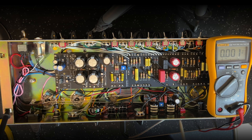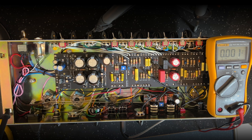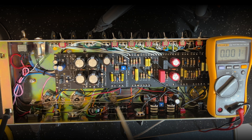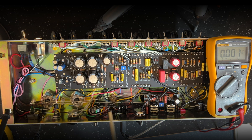With this 25-watt build of the Kelly here, I want to point out a couple of things that might be of interest to anyone contemplating building with one of my boards, or maybe you already have and want to make some changes. These boards — I've mentioned this in the first build basics video — you can pretty much build any wattage with these: 25, 50, 100. The Kelly board and many of my other boards are set up for fixed bias. I do have one board that does cathode bias — that's the mini. But these are fixed bias, so any kind of fixed bias power amp configuration you can do in here.